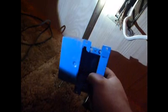Okay, I ran into a bit of a snag with this new old work box, this type for shallow walls. It has this extension on the end. There wasn't enough slack in the old wire for it to give it enough room to twist into there and lay flat. So what I ended up having to do is take the old box and steal the ears out of this and put it in the old box and reuse the old box.